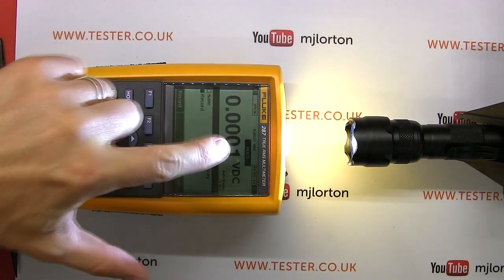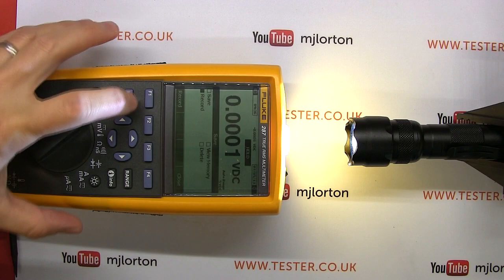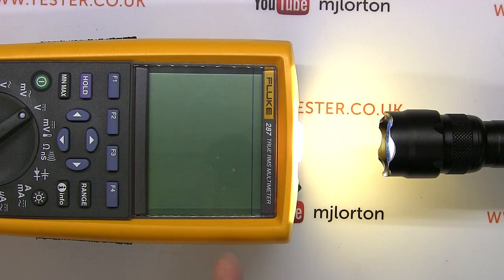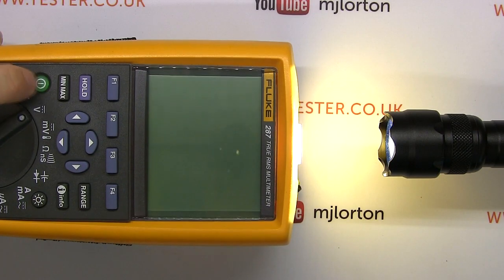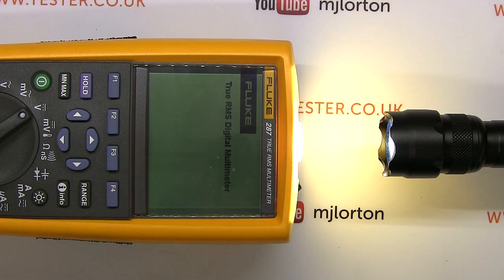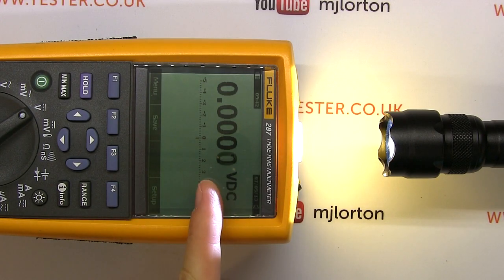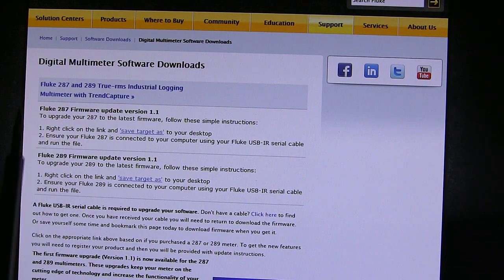I've switched to measure voltage - nothing connected but that doesn't matter. I've set it to record with the light angle going straight into the port. There we go - you'll have seen that line at the top and now the power light is no longer flashing. So sunlight or a bright light going directly into the top causes the problem. The bug is definitely there, demonstrated with the torch. This meter has firmware 1.1 at the moment, so we're going to update to the new 1.16.